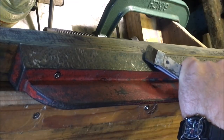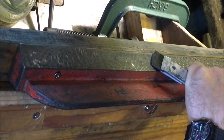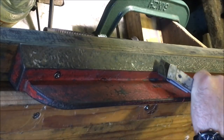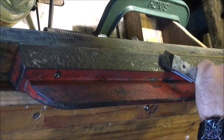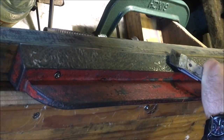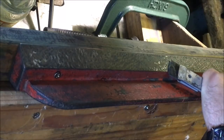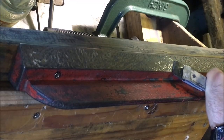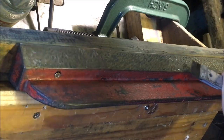The one thing that's an advantage with, I guess, a biax, and I've never used one, I've got one which I need to have a go with, is providing you get a consistent result, picking out the high spots should be very similar. When you're doing it manually like this, the more consistent you were with putting down the crosshatch, the more consistent you should be with generating the high spots, and therefore you can get into a better rhythm taking them out. I can generate waffle like this for quite a long while. So I'll shut up.